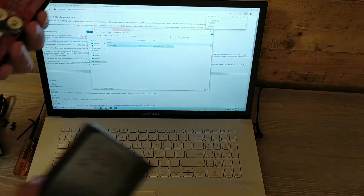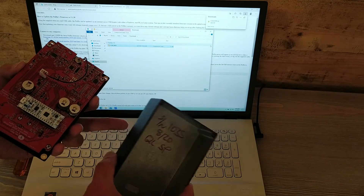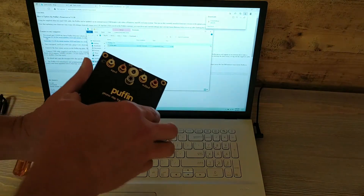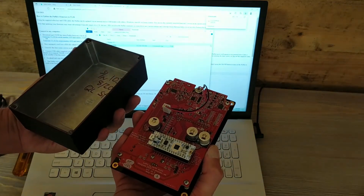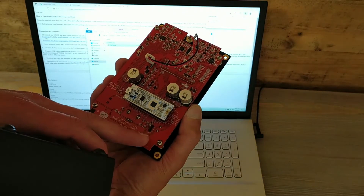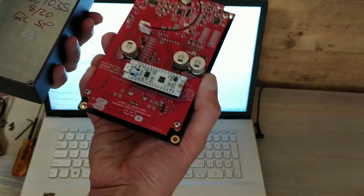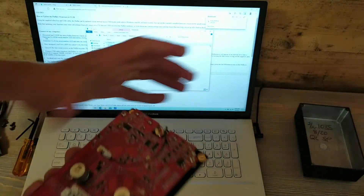So I've opened it up here. Now if you've done the SPDIF mod or purchased a SPDIF mod direct from Parks Audio, there's going to be a wire connected down to your chassis. After you unscrew the four screws, you'll kind of open it like a book to your right. If that connector comes undone, you can plug it back in — there are markings of yellow, red, and black for those that have the newer Puffin with the connector. Those connected to the base will then plug in the cable.